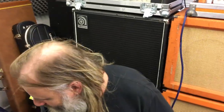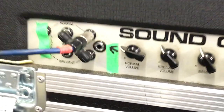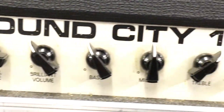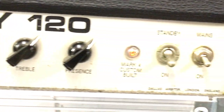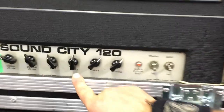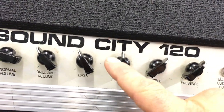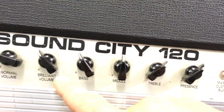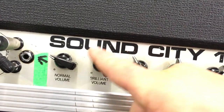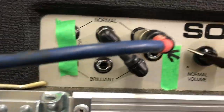You're probably wondering what this horrible racket behind me is. Here we have a 1972/73 Sound City 120 — this is a bass head, the B120, and it runs at approximately 170 watts. Quite a lot of treble. The middle is about half. Everything works well at about 12 o'clock generally. I've boosted the top end, cut the bottom end slightly, and for gig purposes it's all the way around to about 1 o'clock. It's bridged — running both channels.